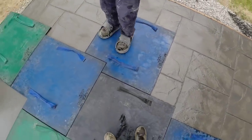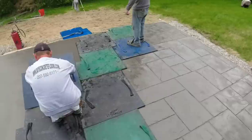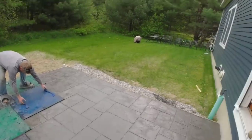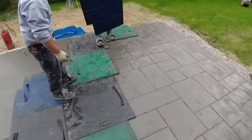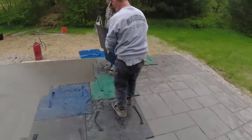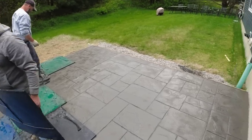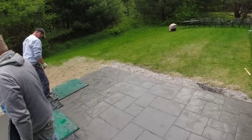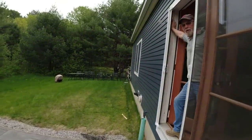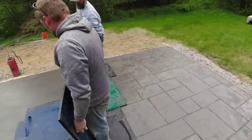These things are pretty thick and you're going across a wide area — yeah, the stamp dance. Now you know — you're watching that other video when it was 100 degrees out, how fast I was working that day compared to the three of us here. I'd be lying if I said I didn't have a thought go through my mind that I might not make it. What happens if you don't make it? Well, there's a product we can use where we could go over it with three-eighths and stamp that product. It's a bag concrete mix — 6,000 PSI, made for that, with polymers and stuff in it.